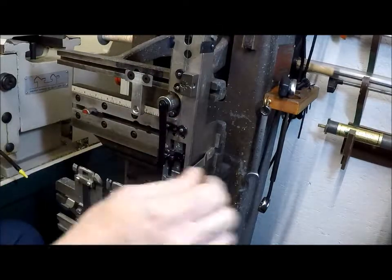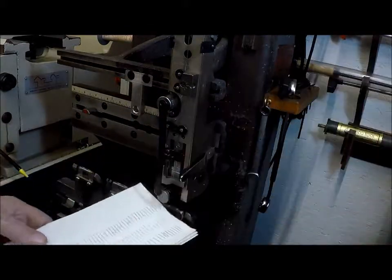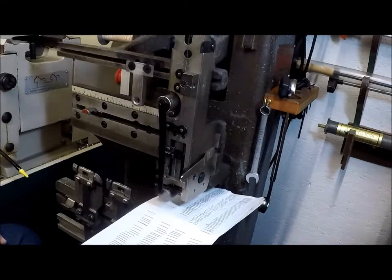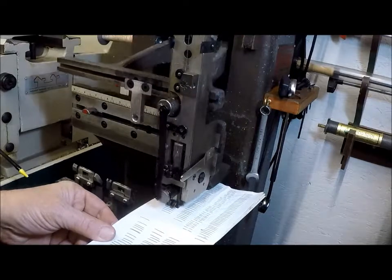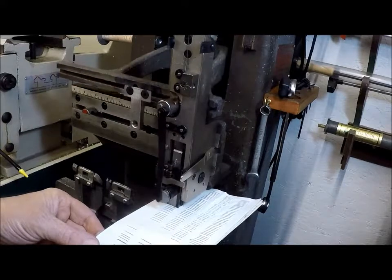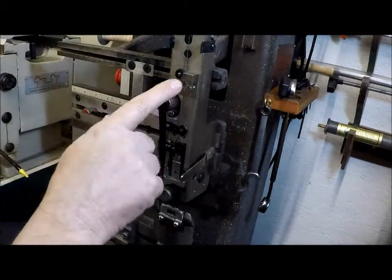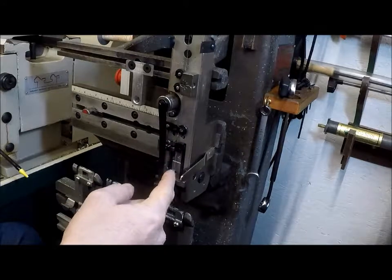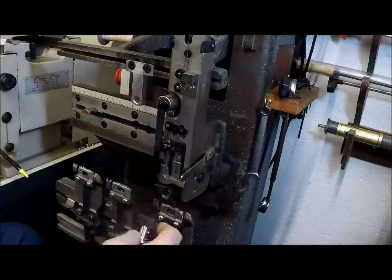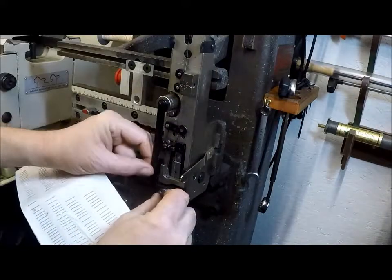Make sure that this is on properly. I could pull this piece of wire out. Now we'll test stitch — which I've already done with this head quite a few times — and we'll just let it run. I ran all these staples, never dropped one. If this adjustment's out of whack, the wire will kink right here and jam up because it's having trouble getting down into this piece — it's crashing into it. So you want the wire to be bent just right to get down in there.